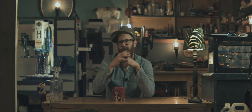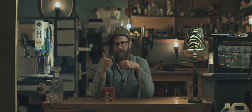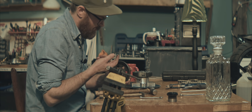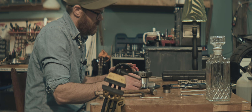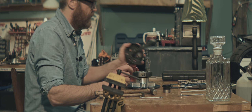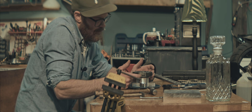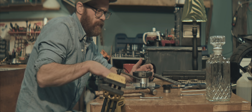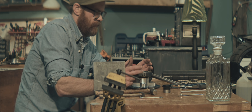Those rose joints on the load cell have a lot of play in them and that might cause noise and wrong readings. I'm just out here to take some measurements. The clutch bell is really shiny and so are the shoes — there's definitely some grease residue there. Do I degrease everything and hope for the clutch to grab, or make a dummy shoe and drill holes to make it fixed gear? Another option is to just drill three holes in the bell, transfer to the shoes, and tap the shoes. That way I can switch between the two by just removing three bolts.